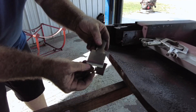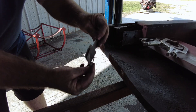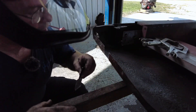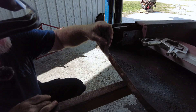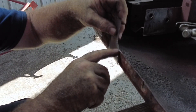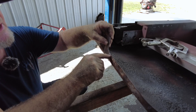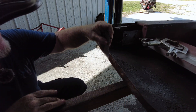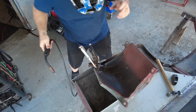Here's the piece I cut out — pretty ragged. This is the piece I made; I left a little extra metal on there to hold it. Got it pretty close, so let's get to welding this thing in. I'll get it tack welded, get it all set, and then cut off the end when done. If you cut the end off ahead of time, when you try to weld at the end it'll always leave a little divot. Leave extra metal and cut it off after — you won't see where the weld ended.